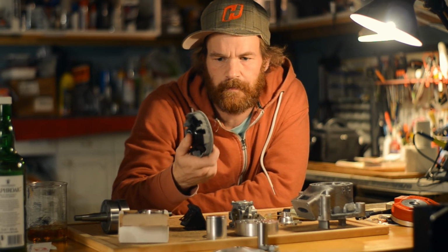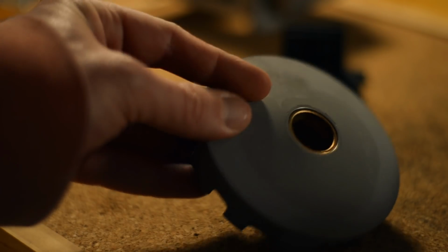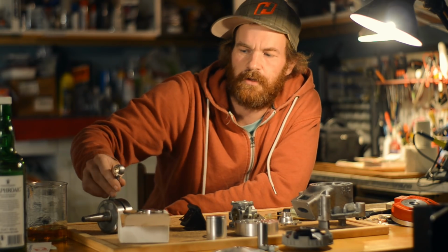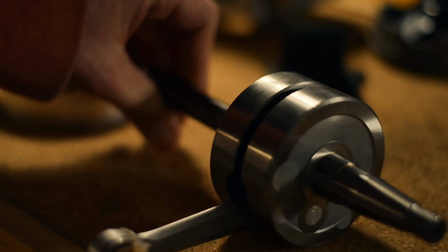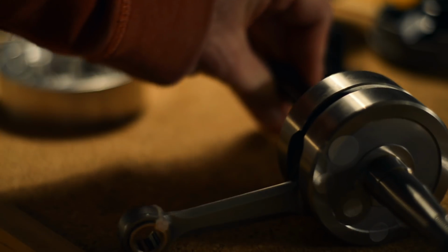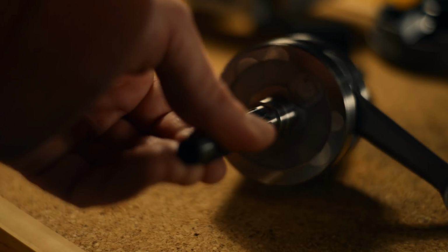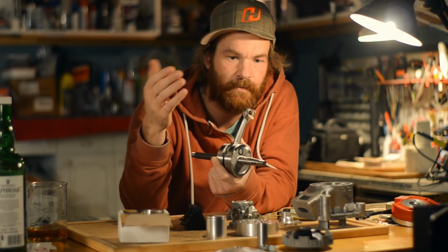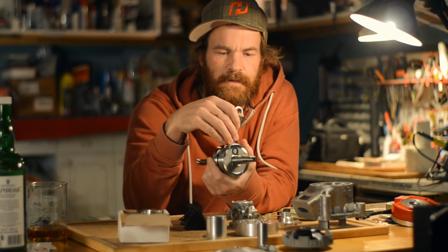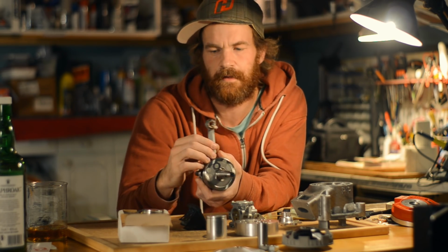Piaggio Stage 6 RT oversize Variator this time, because I'm running a Piaggio RT crank. It's the 39.3mm stroke, but a 90mm conrod. The long conrod because of more port area versus port timing, and also higher ports for the same port timing, but also less angular force or side force on the piston, and that might be kind of important because I'm running the special retained ring pistons,